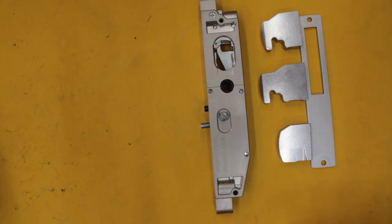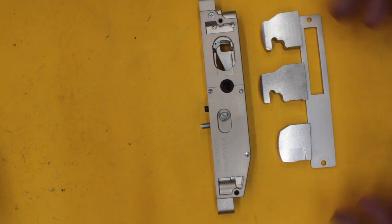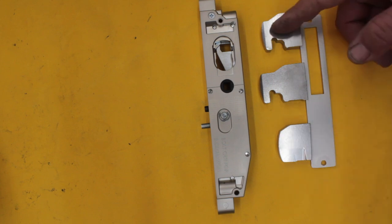This new lock comes out with a different selection of bolts, which makes it one of the first locks to have an interchangeable bolt for this type of mortise lock. Normally you'd see this type of mortise lock on an aluminium shopfront or aluminium glass door where they've got a 50-60mm channel around the edge of the door. This is what we call a flip bolt lock, and often they always came in three different formats: your long throw, short throw, and your hook bolt.